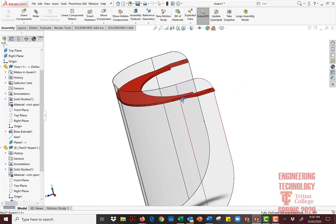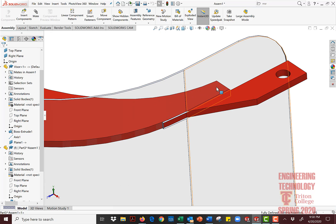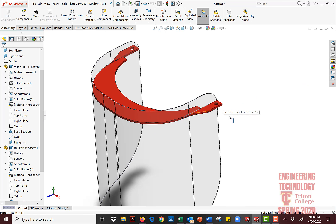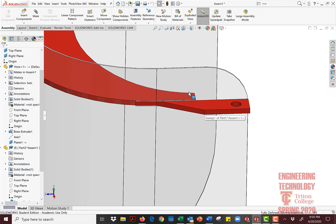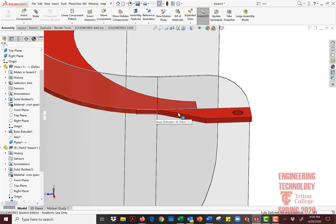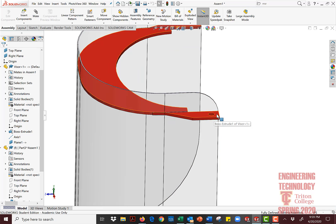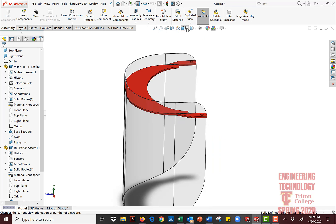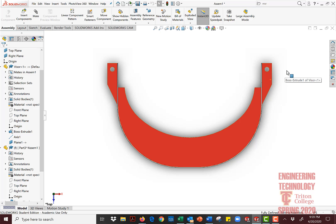I have the two types of material you see on the screen. I have some clear plastic that is .030 inches thick, and I have some 1/8 inch thick plastic that could be used as a top visor. When I have the two pieces together, I've got my design started where I've got my slot so that the two pieces meet. In the prototype though, it physically doesn't assemble well — these two pieces don't work well with each other because these legs are too long. So I'm back to the drawing to edit it so I can fix these two sides.